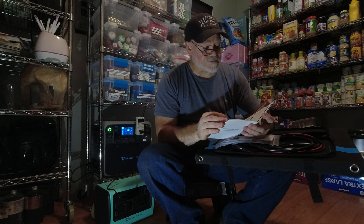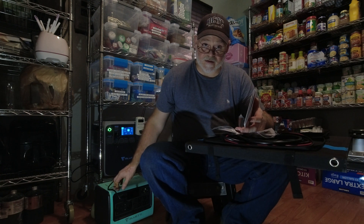Let's talk about some of the stats. It's a 200-watt panel obviously. It is a 20-volt max; the open circuit voltage is 24 volts and the short circuit current is 11 amps. Now when I say you can use this with the AC30 and the EB70, they do have an amperage limit — especially the EB70 — but they'll take up to 150 watts as long as you don't go over the voltage, and the 24 volts is not over for the AC30 or the EB70.